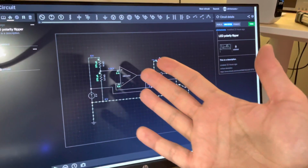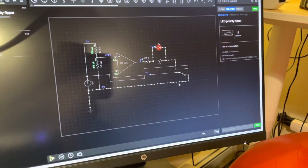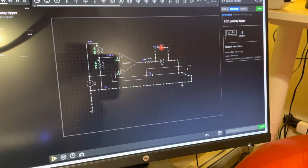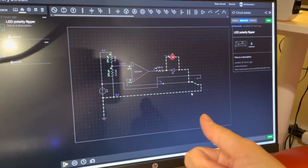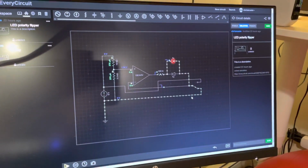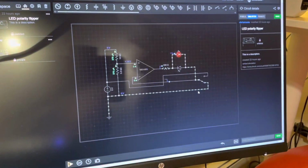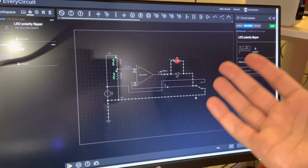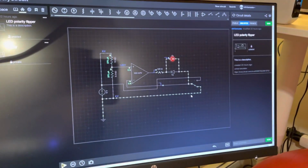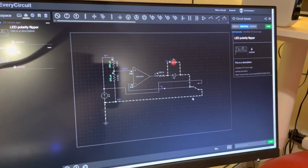And then it occurred to me that it's kind of serendipitous, because the LM358 dual op amp chip, where the other day I used only one of the op amps, I freed up the other one, and this circuit here uses the other op amp conveniently. I thought I was clever coming up with this on my own, and then I realized it's just an inverter. There's nothing clever going on here. But what happens is this gets, well, I can actually run the simulation here.